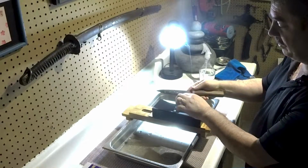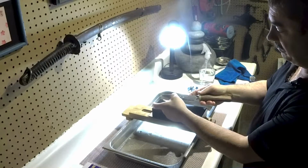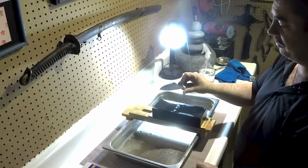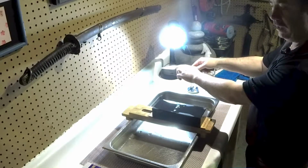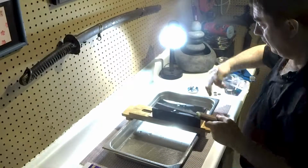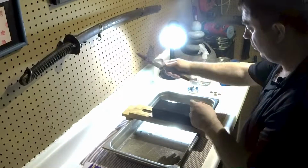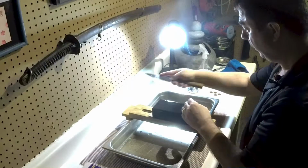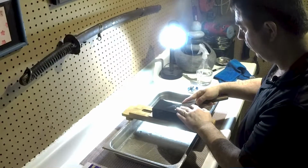You got to thin it out at the primary bevel, and your secondary bevel is going to be right down nice. That's going to be your main edge. It's the first time using it, so I'm not worrying. And I did do that right here. I started it just for the hell of it. Hard to see, but it's nice. But anyhow, this knife is just about ready for anything, but I'm going to put another nice little edge on it. Again, pinch her up nice, hold her, keep your wrist straight, up the center of the stone, get your angle.